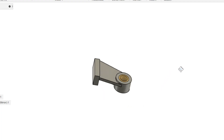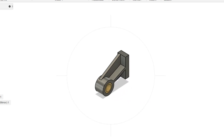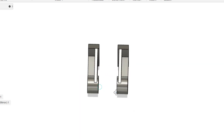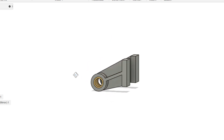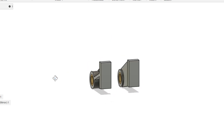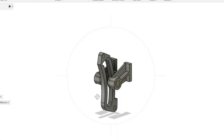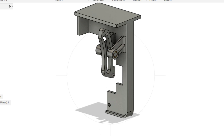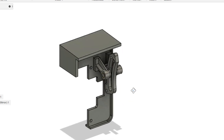The expansion link bearings are another set of small and complex parts. There are four in total, with a pair on each side, and each of those pairs is handed — there's a left and a right. I haven't yet included them in the Fusion 360 model, but there will need to be two tapped holes in the base of each bearing. As well as physically building the loco, I'm also building it in the virtual world of Fusion 360, which is proving invaluable in helping me understand how all the parts are going to come together.